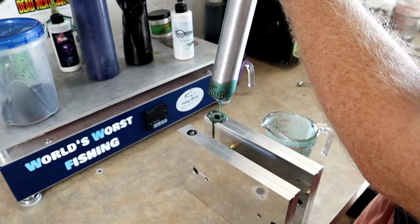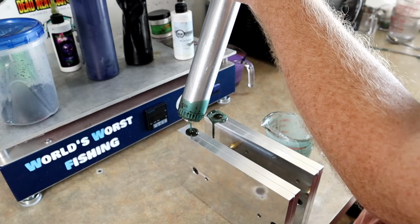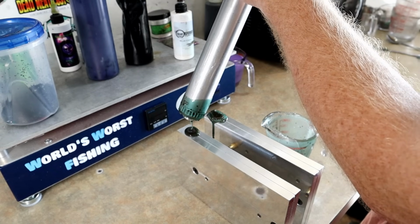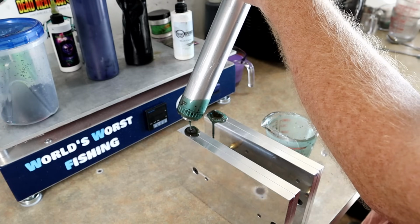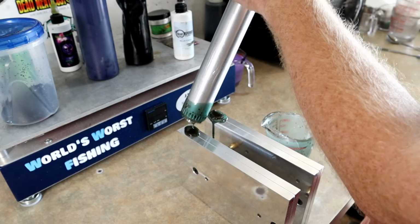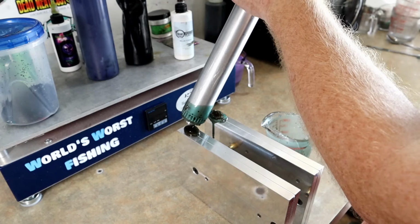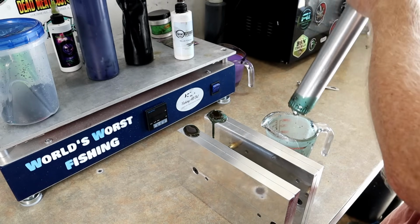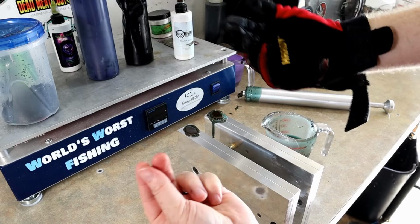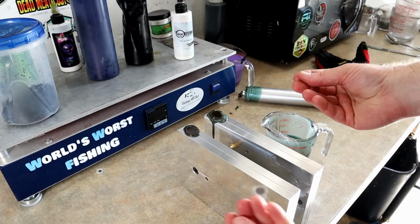Alright. Now this is a big mold with a big runner and big cavities. So we really want to make sure that we're topping off the sprue entries right there. Sprue heads, I guess you could call them. Ports is the real name for them. But you know, this is called topping off the sprues. And we want to make sure that the mold and the cavities have plenty of plastic to pull from as this big mold cools down, or as the big cavity cools down.